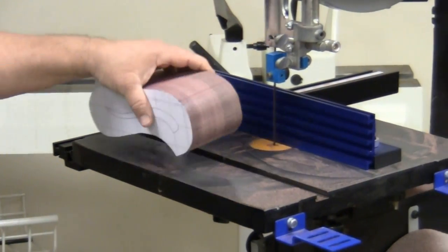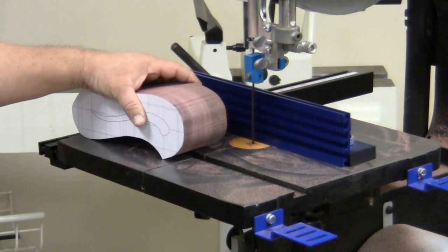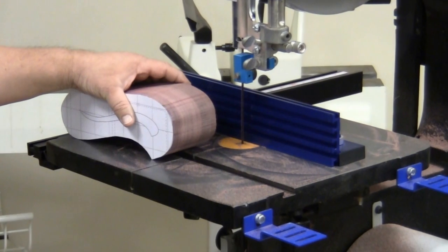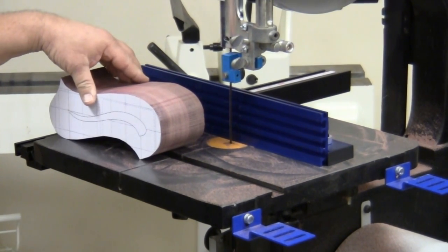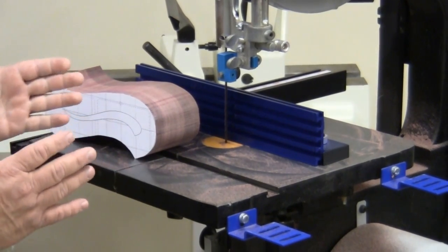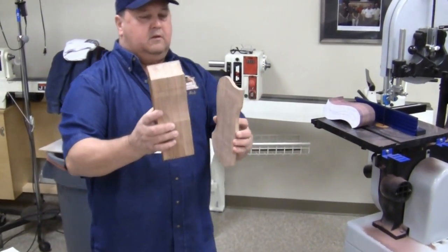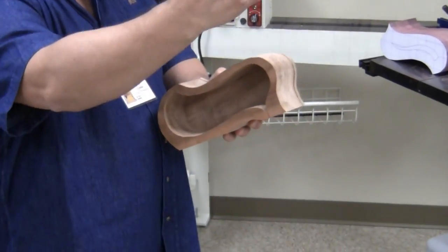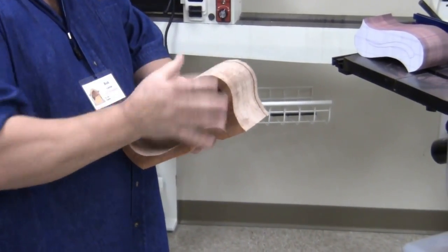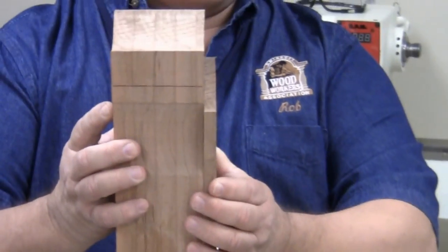So you sand, for the back, on both sides of that cut? No, I sort of mistook on that, because what I did, or misspoke, I cut the back and the front off. If you don't do anything with them, they're going to match up. Right. When I did that one, the back of this thing, I don't know if you can see the curve in there, but I'm off on there. My bandsaw tracked, and the blade started pulling over as I was going through, so I wasn't perfectly straight. But once you glue it in, I don't think you can see the curve on there.